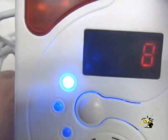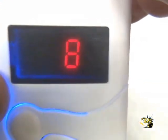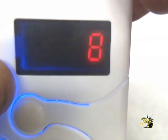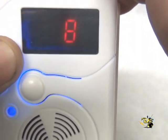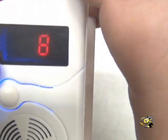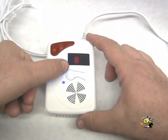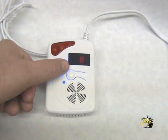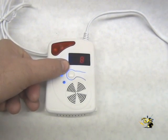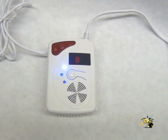You do not want to use these as hydrogen detectors for sniffing out hydrogen leaks — these are strictly alarms. You don't want to trip them more than 10 times a day, so they're not really hydrogen sniffers. You don't want to continually be tripping this alarm. The palladium in there is good for about 10,000 trips, which is fine for an alarm that goes up on the wall.